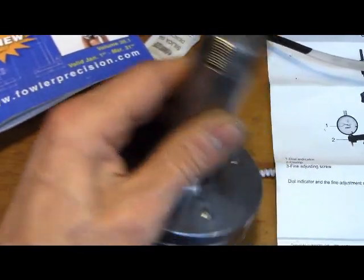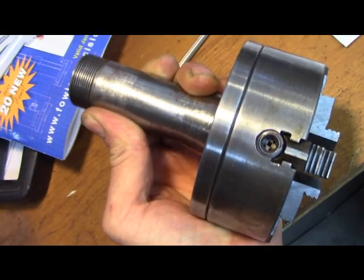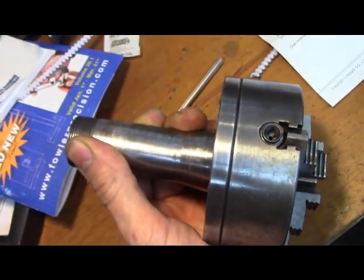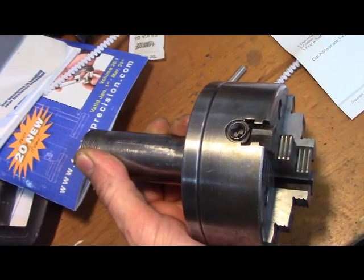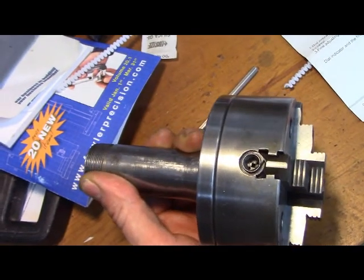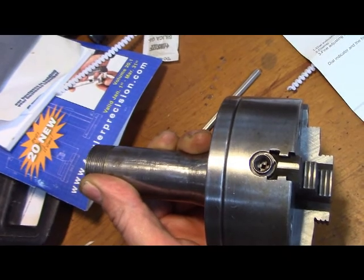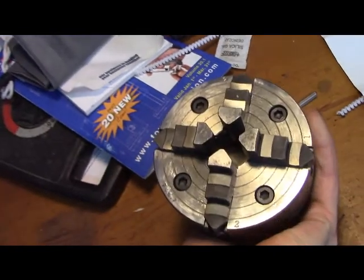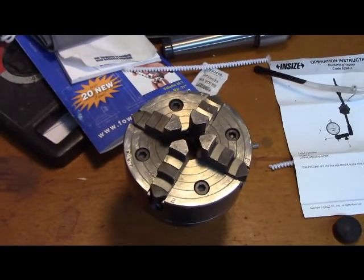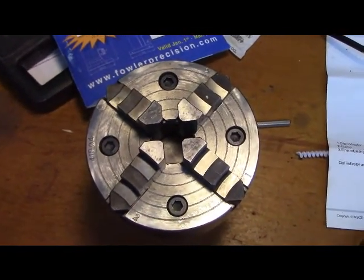So Elgin Tool Works, 5C shank. Oh, the Union chuck. The square drives for the chuck jaw pinions, I thought that was quarter inch, it's not. It's 0.218, 7/32 of an inch. So I gotta make up a chuck key wrench for that. So, yeah, pretty skookum on this chuck deal there.